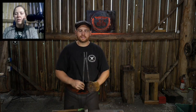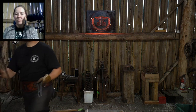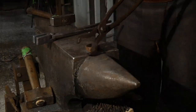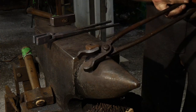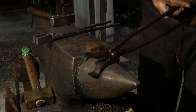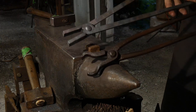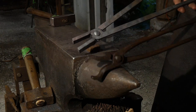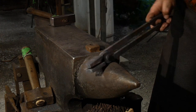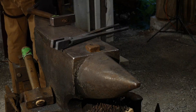This is going to be for the regular flat jaw tongs. Again, like I said, when you get them, you need to shape the jaws to whatever you want them to do. One possible shape, I did this the other day, a pair of tongs I made. Let me go to the anvil. I made this shape to hold hammer billets, hammer stock, or wider chunks. So you could shape these, say, you just bend the nibs out and then bend them around something. Does that make sense? Yep. You see that? So you can make a pair like this to hold stuff. It doesn't just have to be bar stock tongs or just flat tongs. You can shape them really however you like. Yeah, just want to show those off.